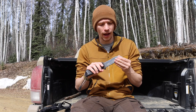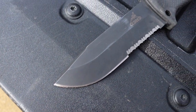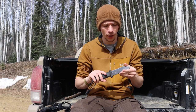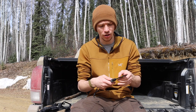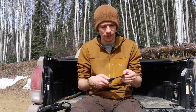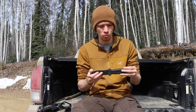Within 10 minutes I also managed to damage the edge, and I was just batoning it through wood, so I'm not really sure how I damaged the edge. But I definitely put some nicks and dings in it, and that's likely due to the fact that this edge was not very well heat treated and it's very soft. So I damaged the edge, damaged the handle of the blade, and also this coating — it kind of looks like a parkerized coating — is actually much weaker than I thought it was. After batoning through probably about three pieces of wood, it's already wearing off in spots and high-wear areas. This parkerized coating is not very durable at all, and all of that happened within 10 minutes.